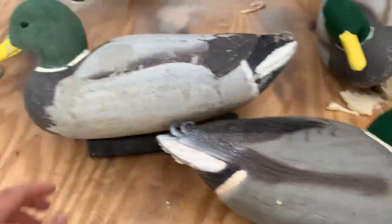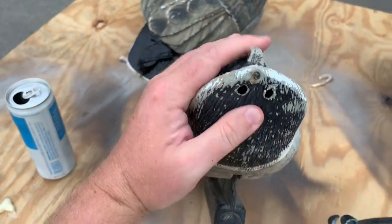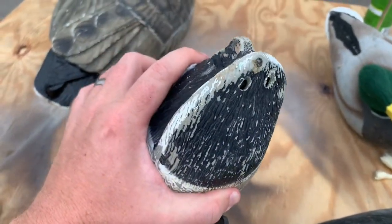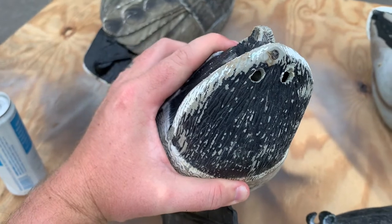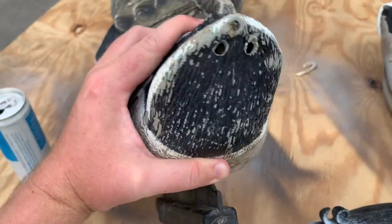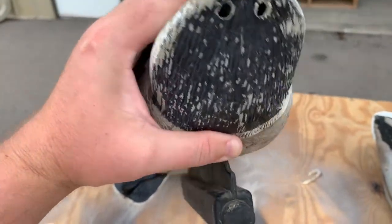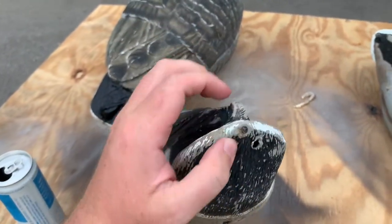So what we like to do is come in here and drill right below the base of the tail — drill a hole right here and a hole right next to it. That'll allow it to vent. When you're using the foam from the spray can, the gas, when it hits the air, is what makes it puff up and turn into foam. So you need a vent for it to be able to vent. And also, that stays above the waterline so you don't get water in there. You can go back over it with epoxy too if you just want to make sure it's watertight.